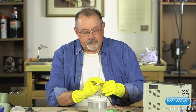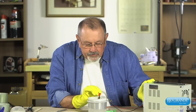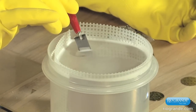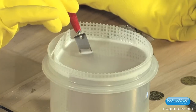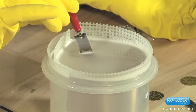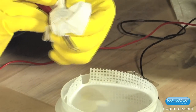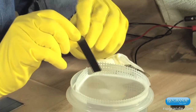We'll start out by taking our piece of niobium, submerging it in the soapy water bath. I'll then turn the voltage up to about 15 volts. And just like that, we have our first set of colors — a nice brown.